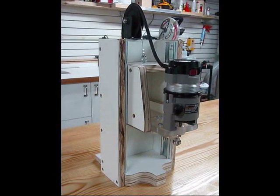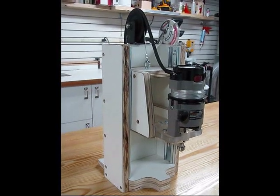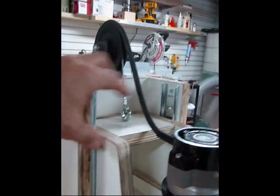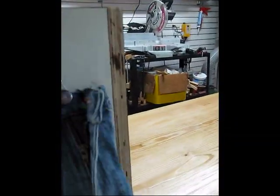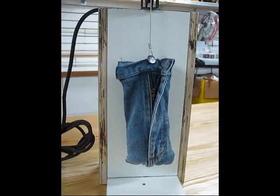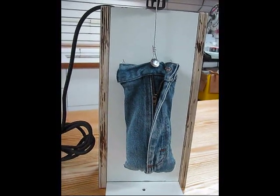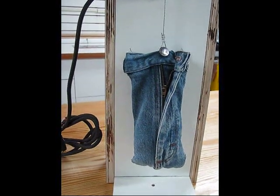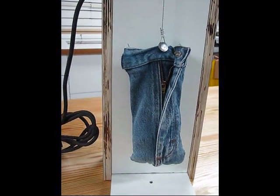The binding machine — the binding machine comes from a design by Mike Doolin. It incorporates a counterweight and a pulley right here. The cable connects to take off some of the load for lifting up and down. I call it the 'sticky fingers' counterweight — for any of you who remember the old Rolling Stones album Sticky Fingers, that was kind of my inspiration for the weight. Inside the weight pouch is lead shot to the weight I need, wrapped inside two zip-lock baggies to keep the dust down.